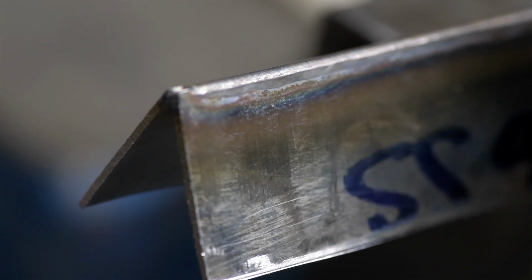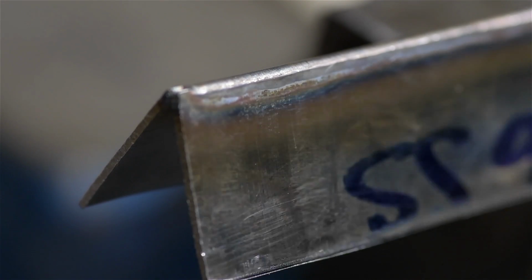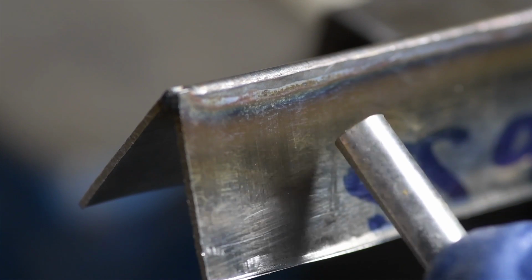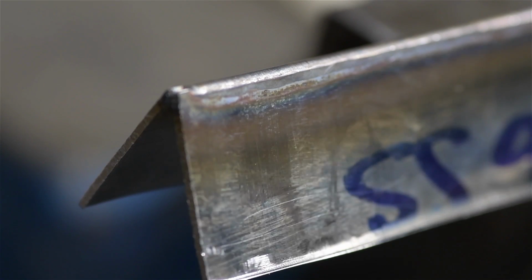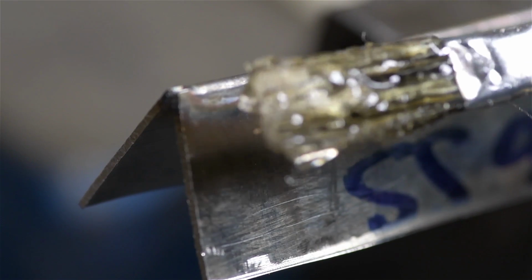The weld is already usually a stress concentration, and so minimizing the amount of heat you put into the weld joint and post-processing is sometimes very important to the performance of the part. In the case of stainless steel, the heat-affected zone affects the material property of the stainless, rendering it not stainless. Pickling paste, or pickling gel in this case, helps to mitigate some of that.